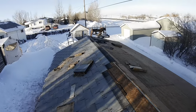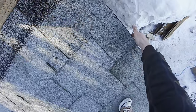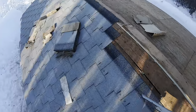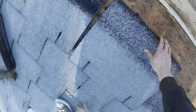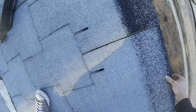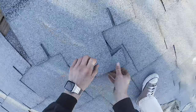These T-locks are extremely wind resistant — the weakest spots are the edges. So on a warmer day I'll just put a glob of blackjack underneath all these flaps and that should hold them down. I sort of like to go in longer stretches like this, just so I'm confident that everything is square and where it should be. Just because this is my first time working with these, I'm a little bit more cautious.